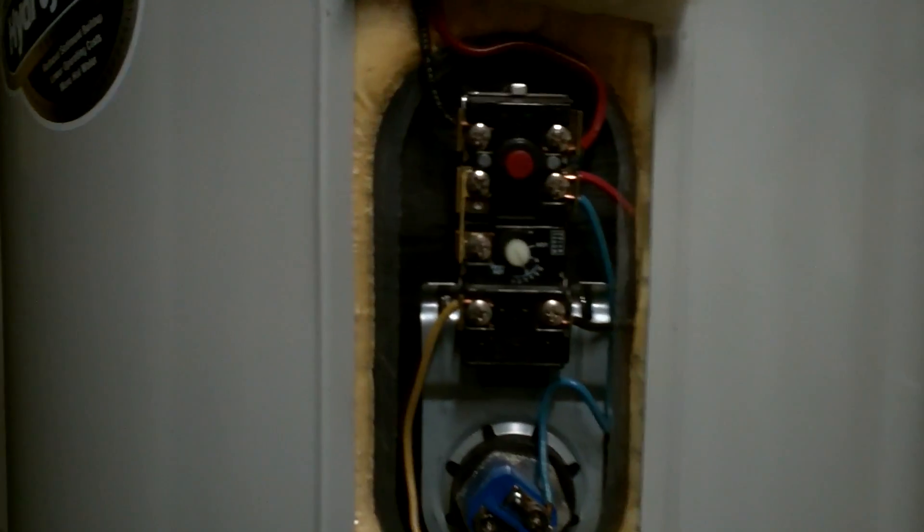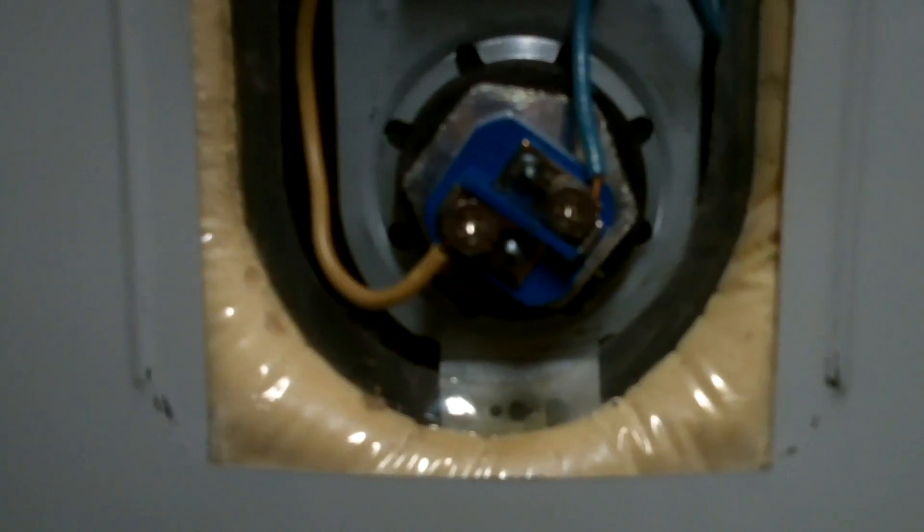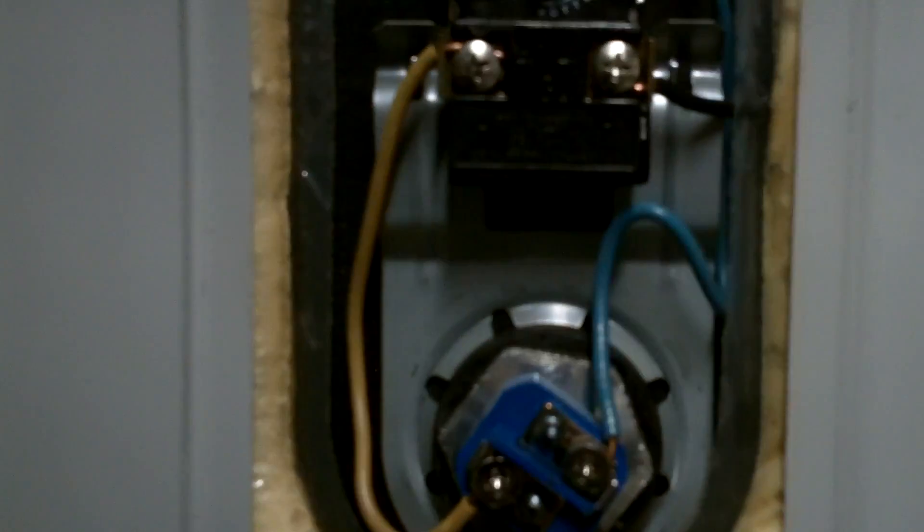One important thing to take into consideration here is wiring. The wiring for the elements does not matter because all you're doing is putting a current through it — it doesn't matter if you wire them backwards or not. But I'm going to try and have the wires set up so they're not stretching across to the opposite side. Here's the other lower element — you can see I turned it about as cold as it'll go this morning when I realized I was having an issue with my water temperature.